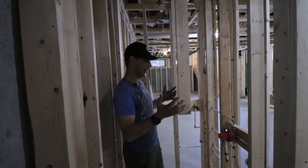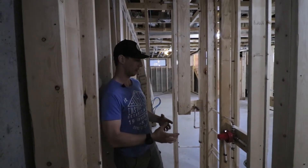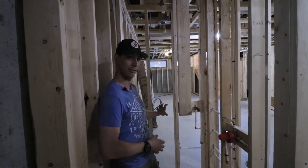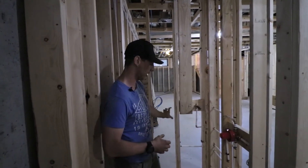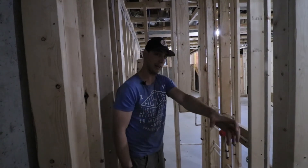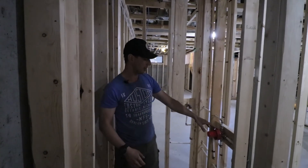In this video we have a guest shower in the basement. Originally the designer and architect designed the valve to be in the middle, but I talked them out of it. When you open the door you don't want to be reaching across to turn the water on and get hit by water. It's a lot better to have the valve right there when you first open your shower door.